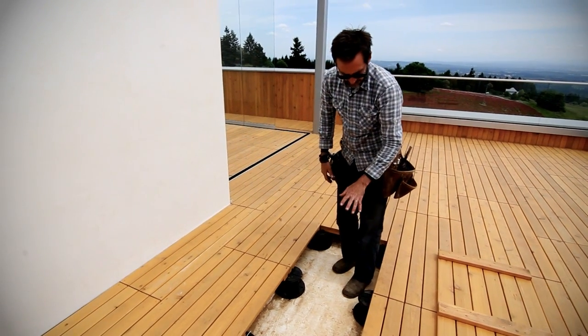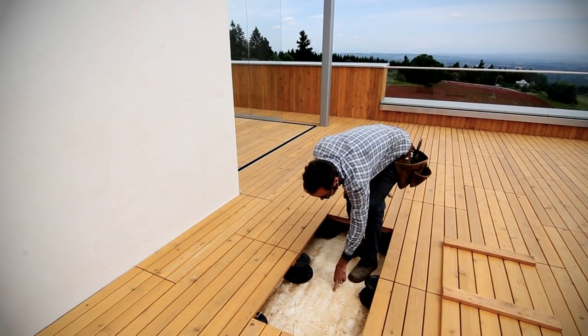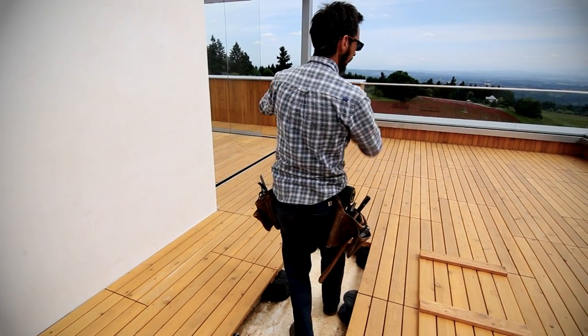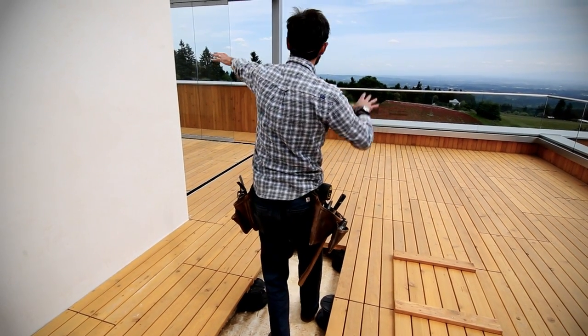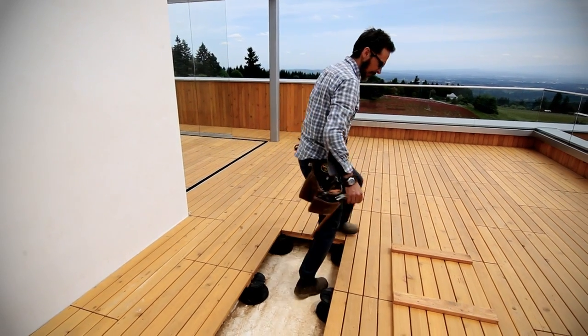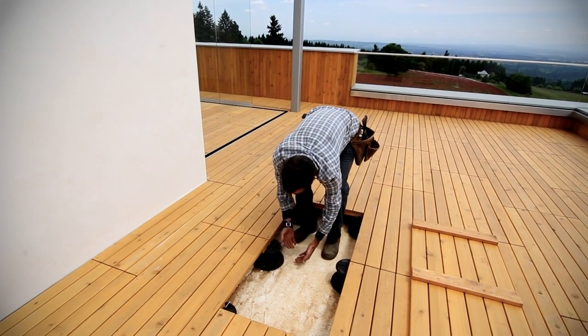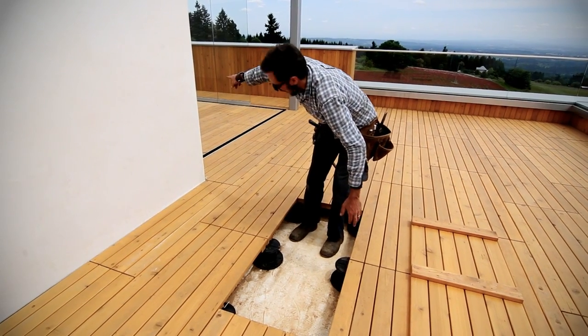This whole thing sits suspended over a roof deck. This membrane here is a TPO membrane. What you can't see from this one particular tile is that this whole roof is pitched to a scupper — it goes up and down with hips and valleys, and there are two scuppers over here. So you need to account for adjustability: right here we might have five and a quarter inches, but over there it's more like six and a half inches.